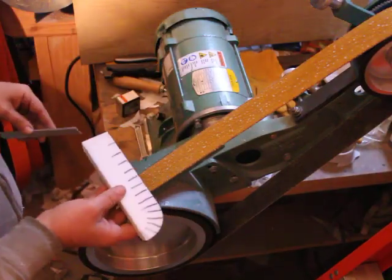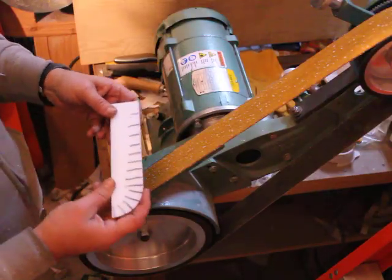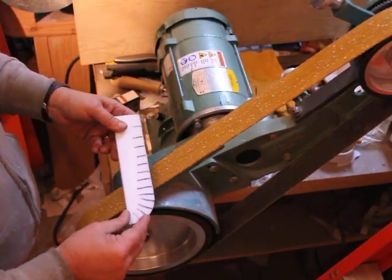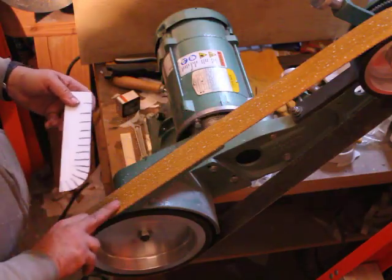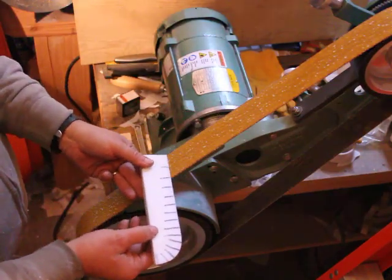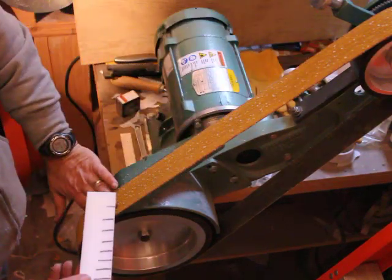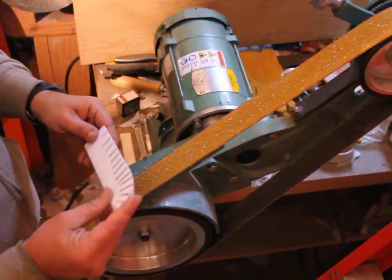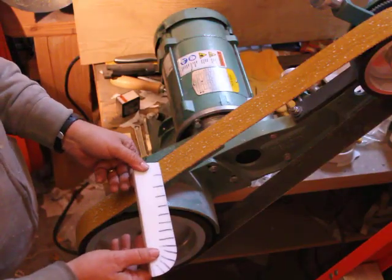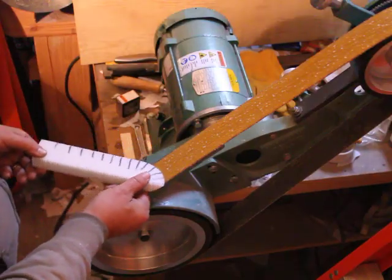What you want to do when you sharpen is to be perpendicular to the tangent of your edge as you abrade across the surface. This is the motion that you would do if the edge is at the same bevel angle as what you want to be sharpening. So here we go — it's like this, like this, and then you come around and pivot.